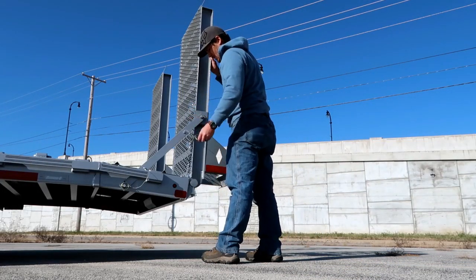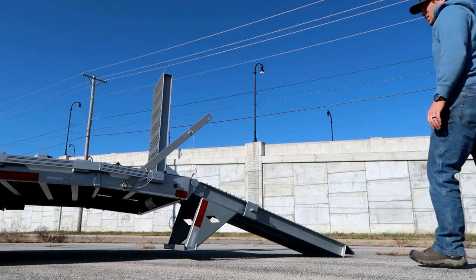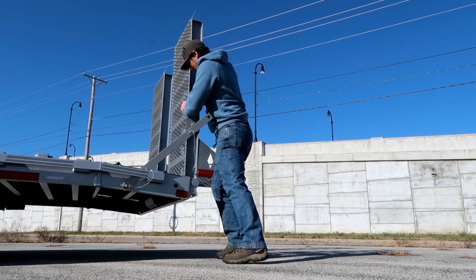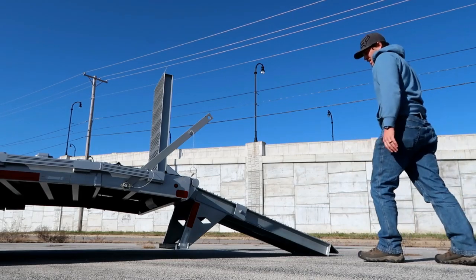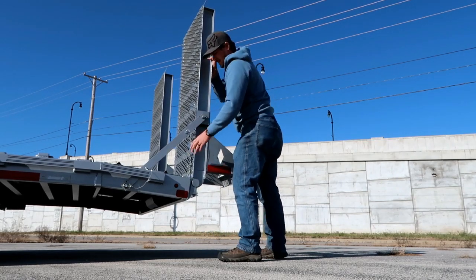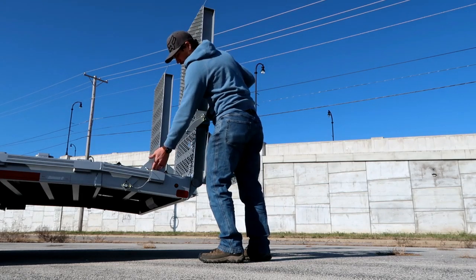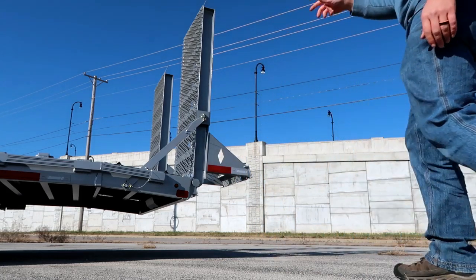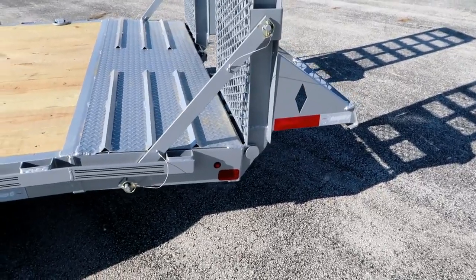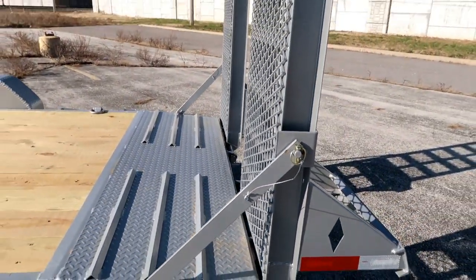Let's drop one of these ramps down. I specifically chose to go with the drop ramps, the folding ramps, and I'm pretty impressed with these. They do slide over if you need to do something narrower — they don't go super narrow, but they're really not too bad to lift up. One thing you do have to be careful with is these support bars — if they get caught with your equipment, you can pretty easily bend them. But having them mounted this way is perfect; it kind of holds them up in the air. I've seen other trailers where those drop to the ground and when the trailer dips with equipment on it, they bend them. That's a pretty good setup — and pretty easy to replace too. Just pull the pin, get a new bar that length, drill two holes, and you're good to go.